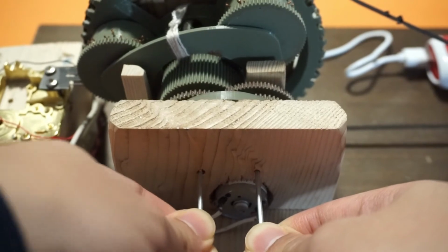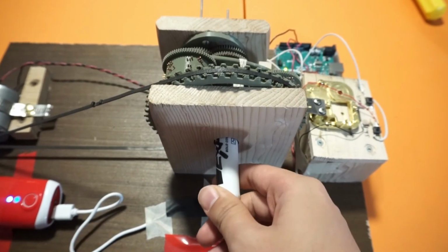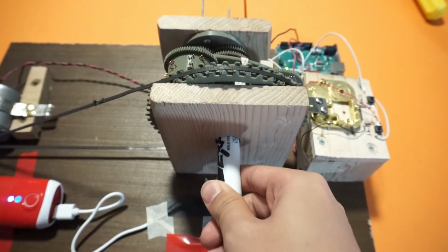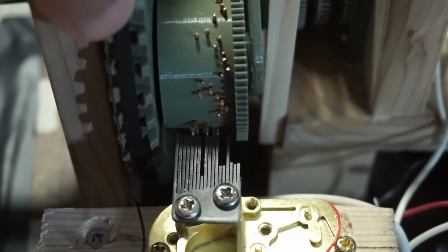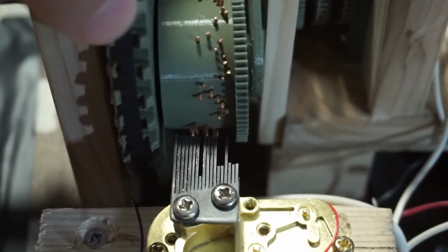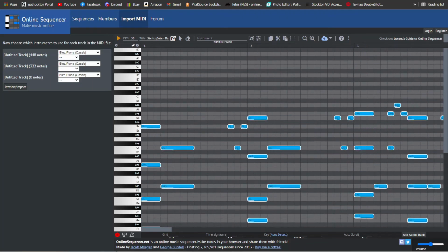Also, there should have been more parts designed with 3D printed material. Using wooden components just became too inaccurate. Some parts were just not straight at all and everything just became loose. As you can see, the shift gear wobbles a little, but since the comb has notes separated by the millimeter, even the slightest horizontal inconsistency will change the songs drastically.